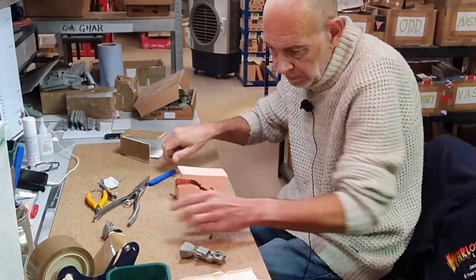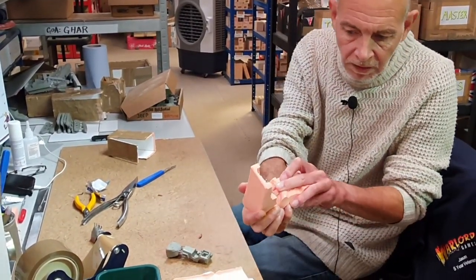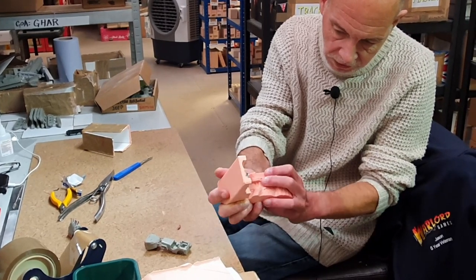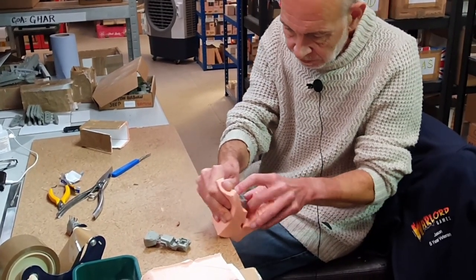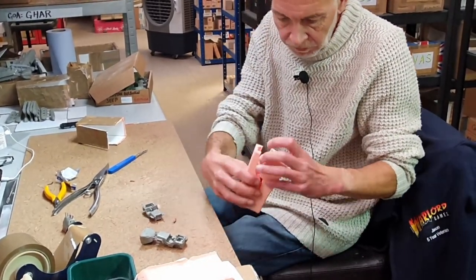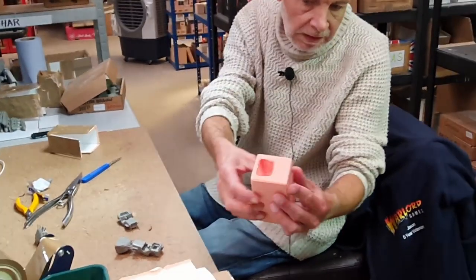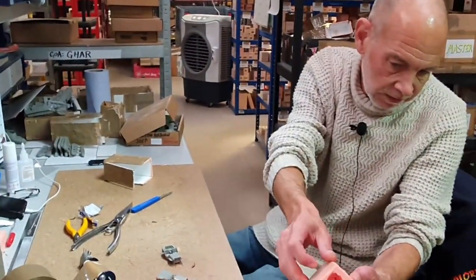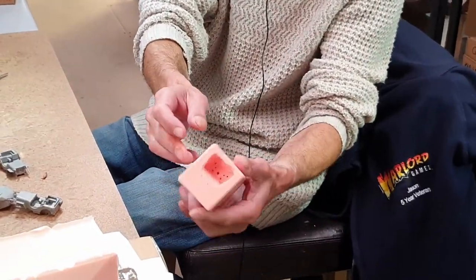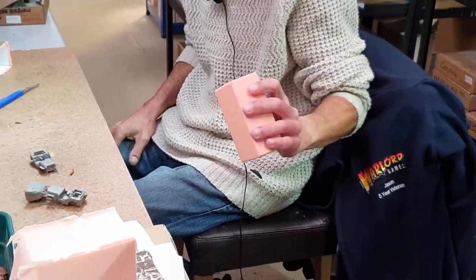When that comes away, that's that piece. As you can see, there's the Jeep inside. That's the original rubber picking up on the wheel arch and that comes away. So, once you can get the model out, the mold's good. That's a good mold now — you can see that's where the resin goes in. You can see the reason for the lock cuts, so when it all goes back together there's very little movement between the two parts, to keep that join as smooth as possible.